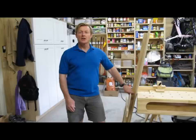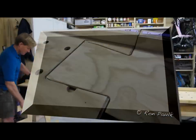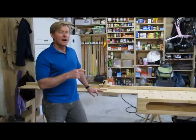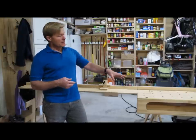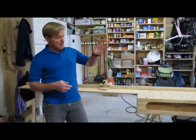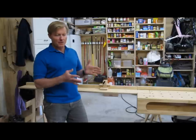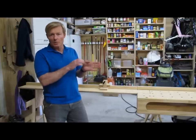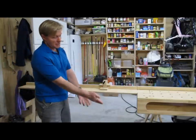When it's time to install a room full of crown, you're going to need to go to the long configuration. Drop that in the dovetail, put that on there, adjust the height if necessary, and it's ready to go. When I'm cutting base and crown, I cope my inside cuts using the Collins coping foot on my jigsaw. With tool storage available beneath the surface on the miter stand, I keep my coping saw there with a long extension cord. Collins provides designs for a fixture that you nest the crown in that keeps it at the right angle so when you're doing the cope it's easy to follow. I have that fixture and simply bring it to the end I need to cope, make the cope, and put the material down on the stand.